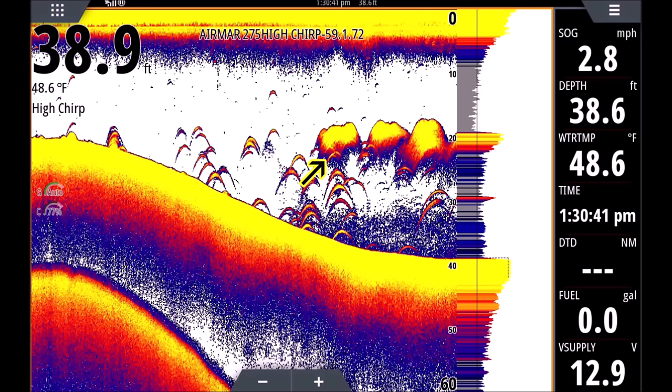So we have our bait schools here. We have our arches. Let's look all the way up to the left here. A little bit of shallow water. You're going to see two bumps on the bottom. Those are stumps. We can tell that they are stumps. It's not bait. It is not fish because there is no separation. You can see it's connected to the bottom. So when you see a hard return like that,